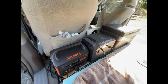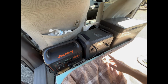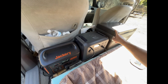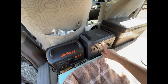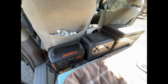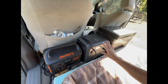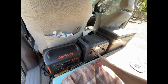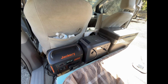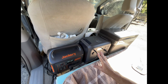So if I was looking at the AC180 Bluetti, it has 1800 watts to start, but 1152 watt hours. This refrigerator, when it's running, usually pulls, it'll tell you, I don't have it turned on right now, it's just kind of mocked up, but it's typically pulling 30 to 40 watts when it's actually producing refrigeration. And then when it stops producing refrigeration, of course, it's not drawing anything. But say 30 watts of draw with 1152 on tap means this would last about 3 days running this refrigerator with no extra input.